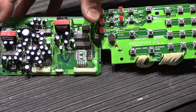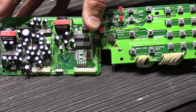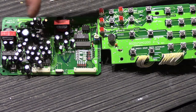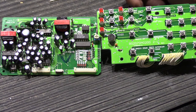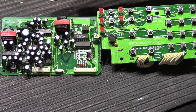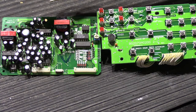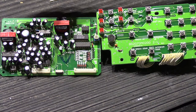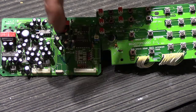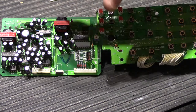If you strip away the radio, cassette player, and related circuitry from the master station, what you end up with is something very similar to this remote station. The control unit has a power supply that powers the remote speakers, but from a functional intercom and audio standpoint they're very similar in design. Because every station has individual volume controls for music and intercom, each station has its own built-in little amplifier. With 12 remote stations, you have 12 amplifiers throughout your house. Adjusting the volume controls adjusts the gain of the different inputs to each amplifier.